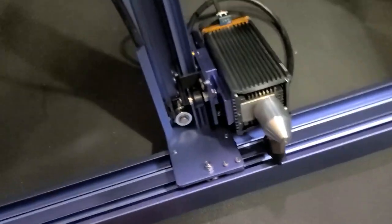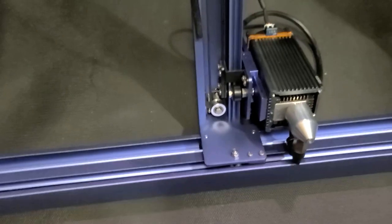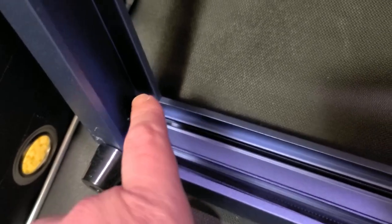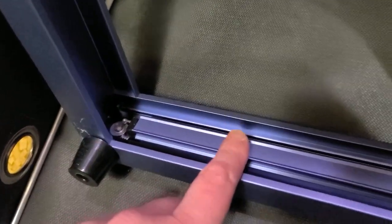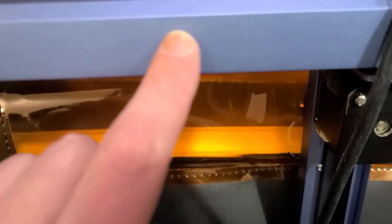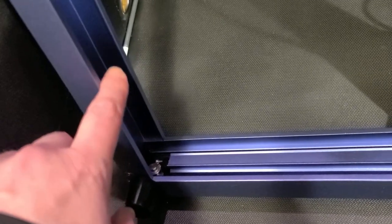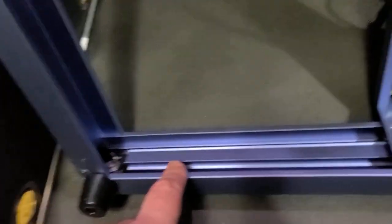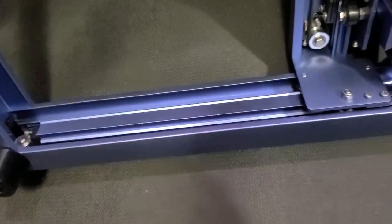And another quick thing I'll mention, because it's easier when I have it tilted up like this, is this is a more modern one. It has a more modern design. You can almost see in there, but there are these aluminum blocks. So this is all extruded aluminum. These two side pieces here and up here are solid aluminum. And then this is more thin wall aluminum, and this piece bolts into these via three screws. Two screws right into the aluminum, and then they have another block. So this frame's actually pretty rigid.